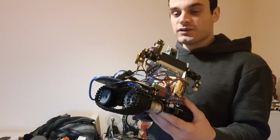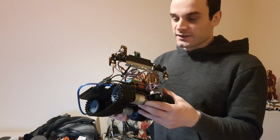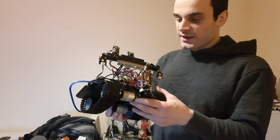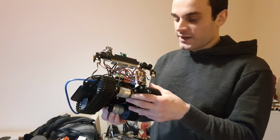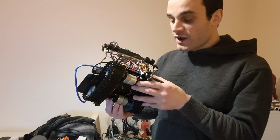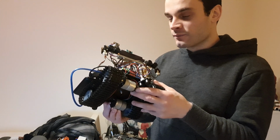All those ultrasonics are used to avoid objects because it can detect them. It bounces an ultrasonic signal off of objects, it bounces back, it gets the distance from them, and using that information you can program it to avoid running into things, which from my testing, for the most part, it does, but we'll get to that in a bit.